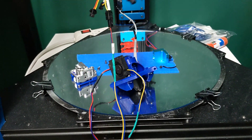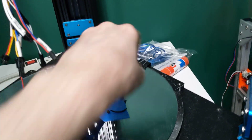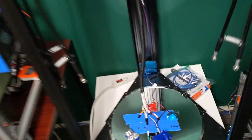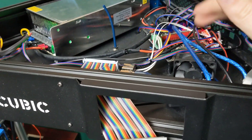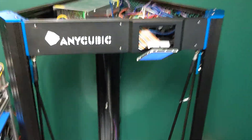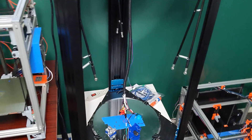It's nice that I get to reuse all the wiring, and there is a mount here for the magnet so I can run the existing auto level probe — very minor hardware changes to this printer. I'm very happy with the choice of mainboard. If you're converting a Delta over to Klipper and need to replace the mainboard, the SKR2 is a really good option. It's compact, fits in the spaces very well, and has a two-pin probe port which is really nice for Deltas that use a little end stop switch as their probe.